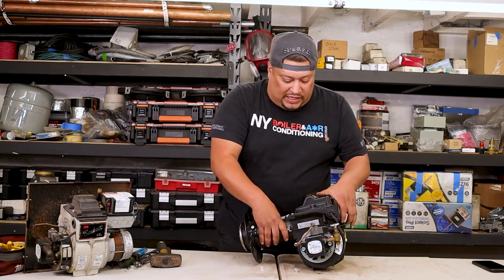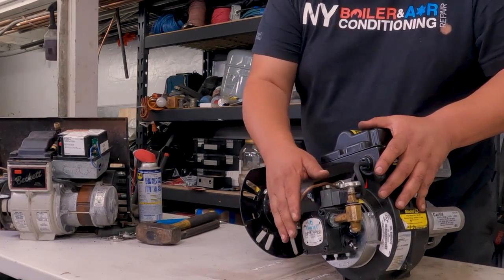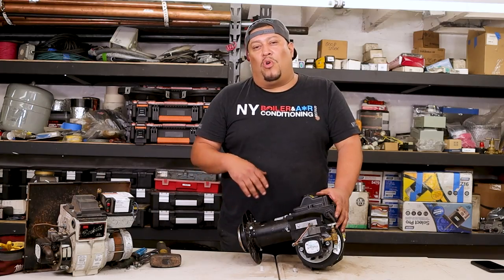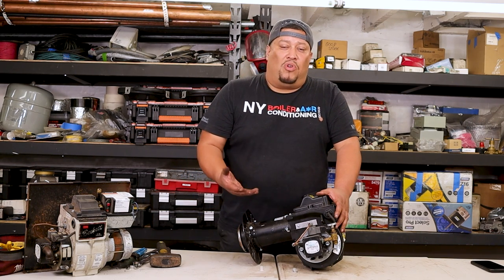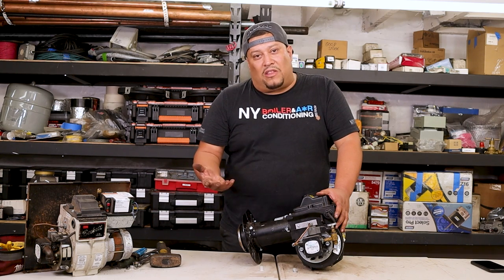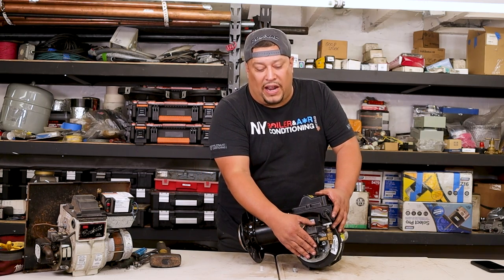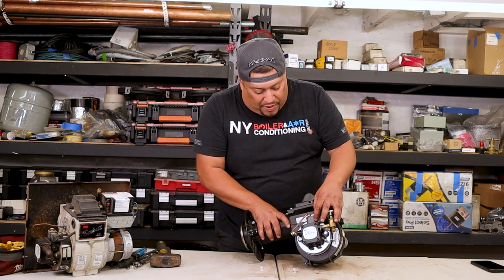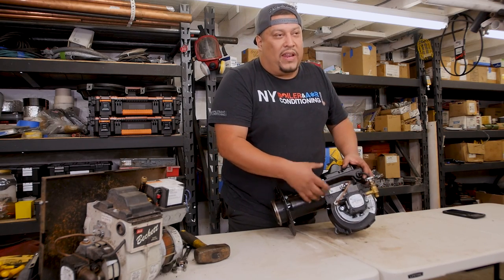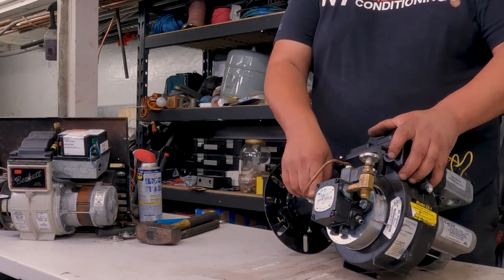This is an oil pump. The typical oil pump we use nowadays is an A pump. On old units they used to use a pump called a J pump. We no longer use J pumps on oil burners, but they're still out there. In this case we work on an A pump. This A pump has what's called a delay valve and a solenoid valve right over here. It's just a plunger — when it gets energized, it pulls that little plunger out and lets the oil go through.